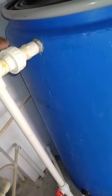When you reach over this side, the water comes up through this elbow right here. This is the lock-off that controls the flow of water inside — it's always left on because there is a high-up valve at the top of the drum. Then we have a socket union, a female adapter, and the ball float inside the drum.